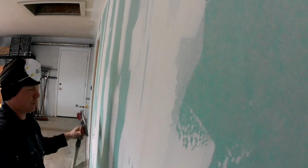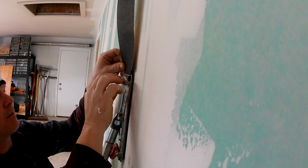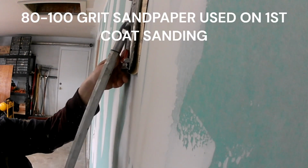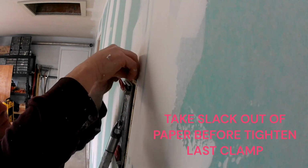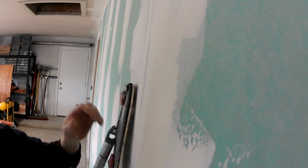Some people prefer 80 to 120 grit sandpaper. If the area is real rough, you want an 80 grit; not so rough, then you kick it up to 100 grit, 120 grit. Once you go above 120 grit, say 150 grit or 220 grit, that's more of a finish sanding. When they do a perfect smooth wall, they almost go with a 220 grit because it's really fine. The grittier it is, the more scratches you may leave behind. So that's why you just go through.